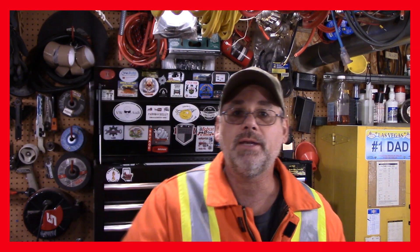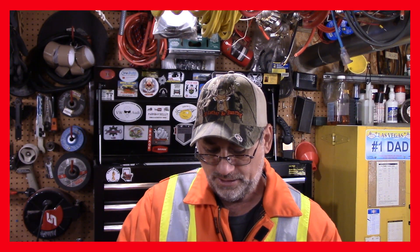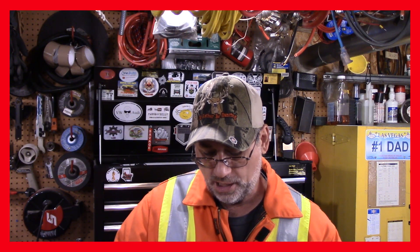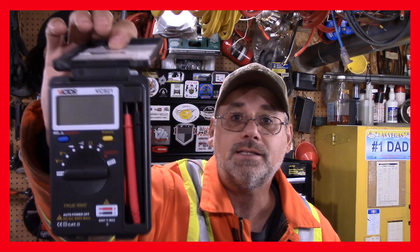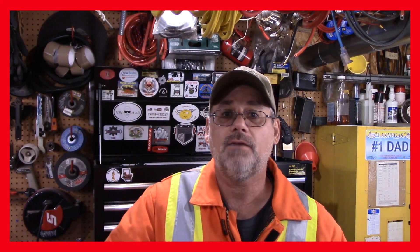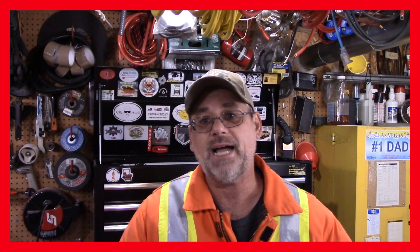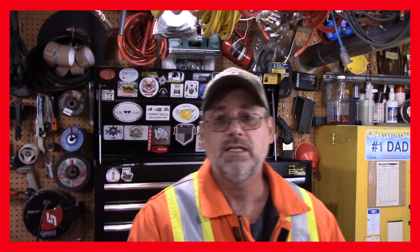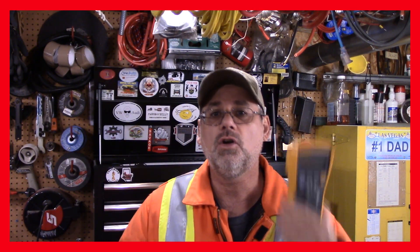This is what I use — this is one of my meters. This is another meter I got, just a cheap meter. This is the cheapest meter I got and it works fine for this too. It's a small little compact job and I like it. For automotive use it's completely fine — just for testing batteries and 12 volt circuits. This one I wouldn't plug into my mains in a million years. The Fluke I would trust.